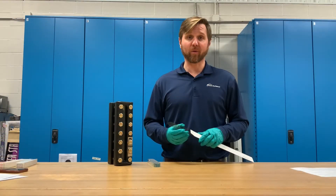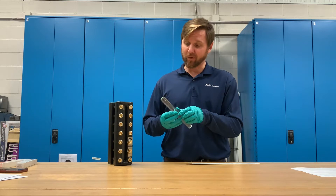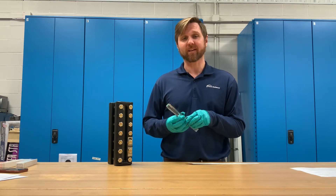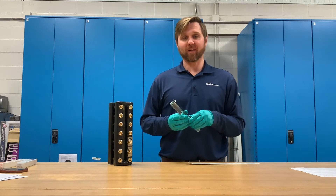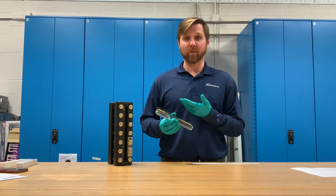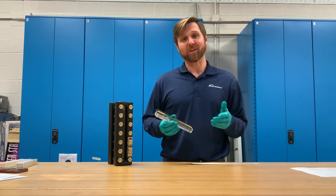So what is mica used for? Mica is most commonly used in steam service. It sits over the face of a transparent piece of glass and protects it from steam. Steam can be particularly harsh on borosilicate glass. Over time it will corrode the glass and eventually lead to failure. To slow this process down, a mica shield can be very helpful.